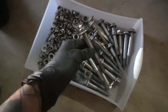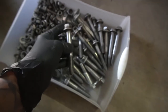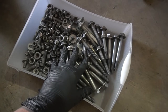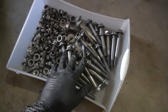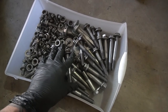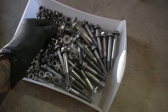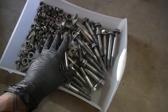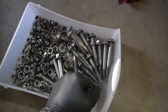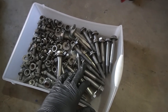We're back from the parts washer and I'm amazed — they look brand new. Some still have rust and pitting, but I have new bolts and nuts for those so I'm not too concerned. Now I'm going to look up what I need to do to prep these for Cerakote. I can't take them to a sandblaster since most shops don't want to deal with small hardware — it's tedious. So I think if I just scuff them up somehow and spray the Cerakote on, they should be fine since these bolts won't be constantly removed or handled with tools.